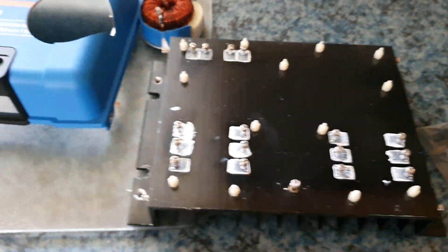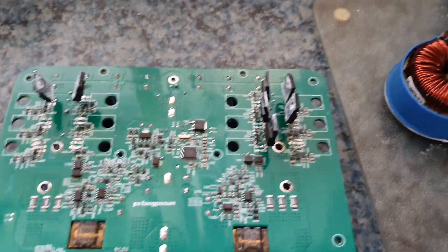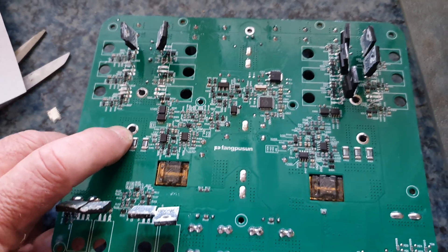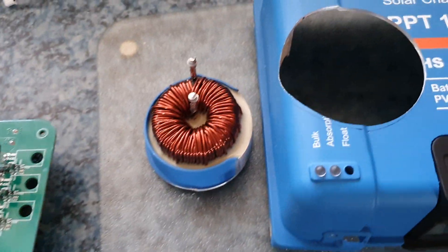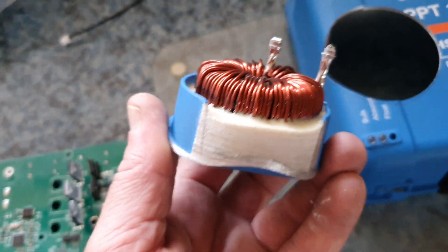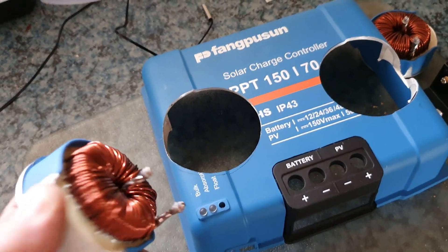It's about to be a trial to see how it all goes together, and whether I've actually damaged the printed circuit board when I pulled it apart, because these coils have been ripped out due to the way it has to come apart - you can't get in there to solder because the coils are assembled in here. Then they pour a resin around these little encapsulated cups that hold them in place. I don't know how much heat these coils produce or whether I'm going to lose some heat dissipation on the cover lid, which is an aluminium die cast.